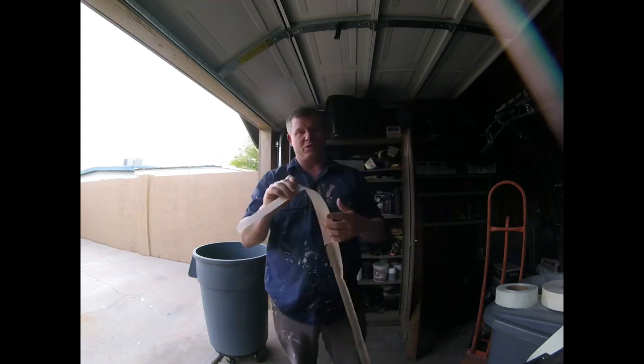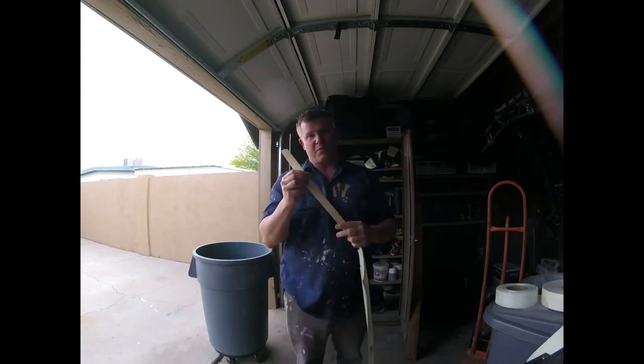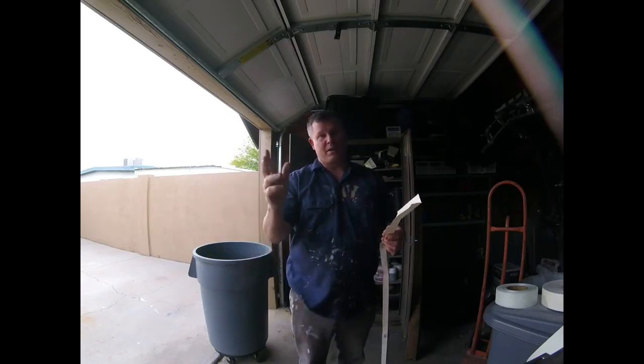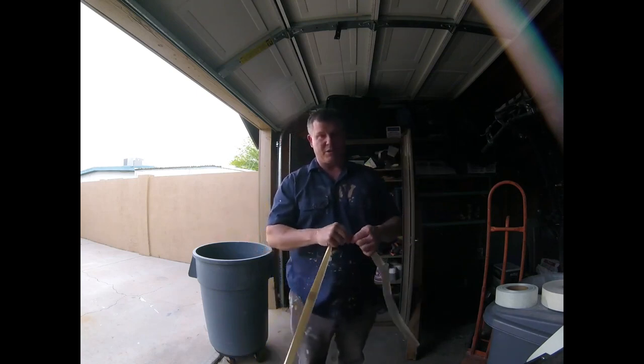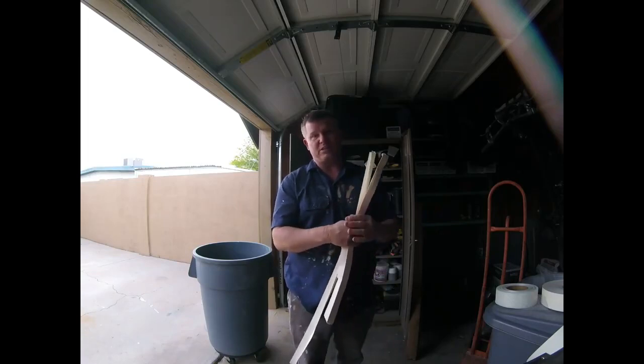And for that, you want to use regular joint compound. With regular joint compound, it's the old style method when it's a bigger job where you coat it, you have to let it dry overnight, turn around, second coat it, dry, sanding. So I recommend using that technique if you're not really good with drywalling. Always use a joint compound, because that way if you do make mistakes, at least you can sand it down the next day.